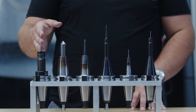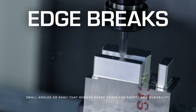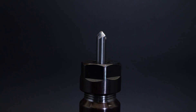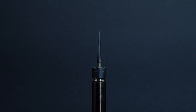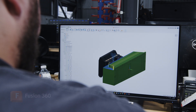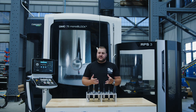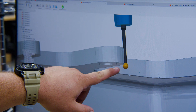We use different tools depending on the geometry. For standard edge breaks on our 3-axis parts, we use a 45-degree chamfer mill, usually a quarter-inch. For more complex shapes, tapered ball end mills work great, especially with Fusion 360's deburr toolpath, which lets us follow the 3D contours cleanly. And for those hard-to-reach features, like the backside of a hole, we use lollipop end mills for our multi-axis machines.